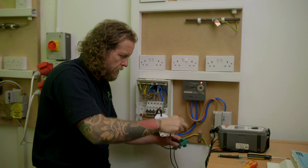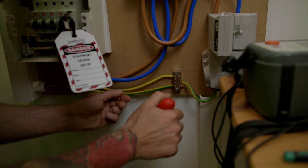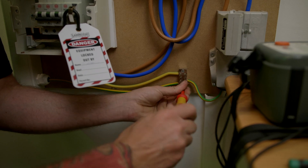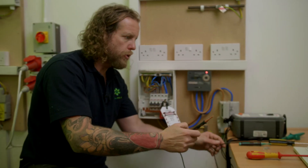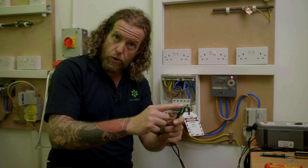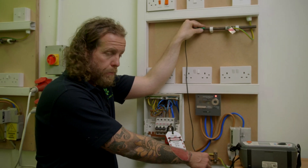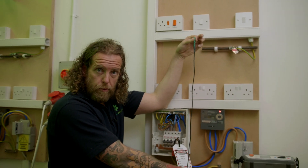You must put this away straight away — do not forget to put your main bonding back. So I've done my water, and if I had gas, I would do gas. If they're not next to each other, in a normal house what you would do is get one of these leads — the R2 cable that you buy — connect it, put it in between, zero it, and you're just going from there to there. You've made the cable longer, zeroed it, and removed the resistance.